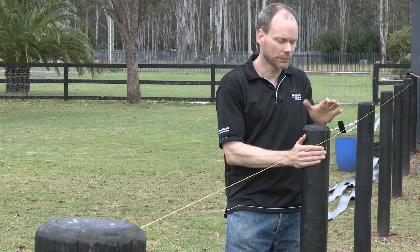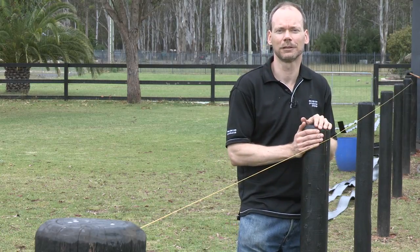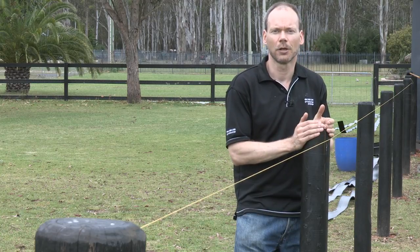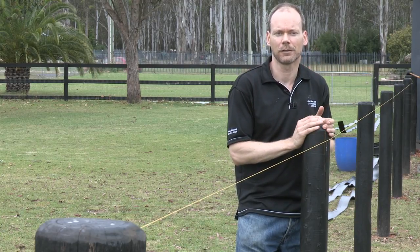About our interim posts: our customer today has chosen a 120mm treated pine timber post. We wouldn't recommend anything less than 100mm because of the potential of breaking the posts.